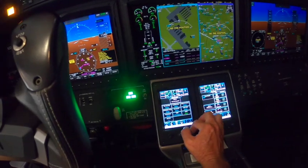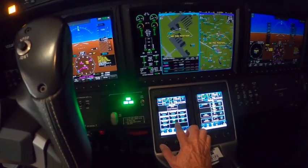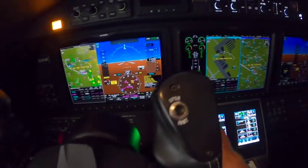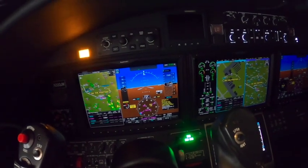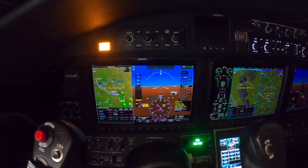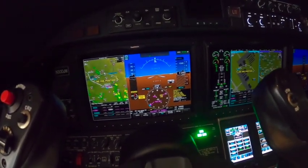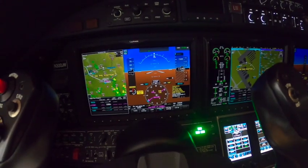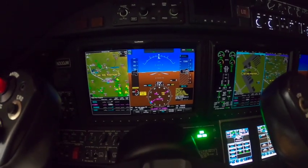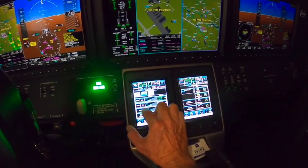Annunciator lights up — all our lights. GPWS test — this may or may not pass because we're inside the hangar. System check — oh, it did pass. I thought it would fail inside the hangar. Then radar altimeter test — I just missed it, but the indicator moved, going to 50 feet like that. Getting all kinds of lights mainly because I'm inside the hangar. Radar altimeter went back to zero — and it passed.